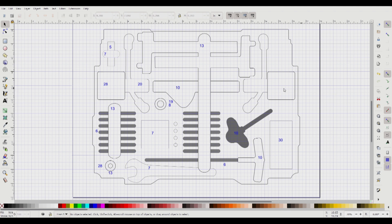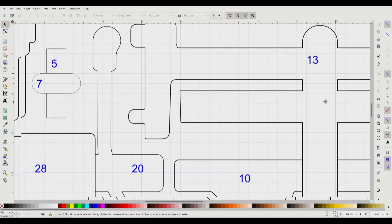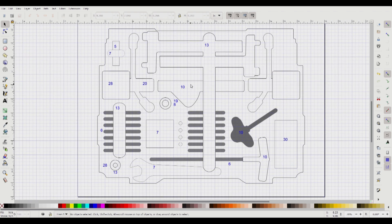My hack around that was to export the Shaper files as an Inkscape SVG, and then change either the resolution or the scaling of the new file. I spent hours altering app and file preferences as well as measuring the physical parts against the drawing to confirm correct sizes.